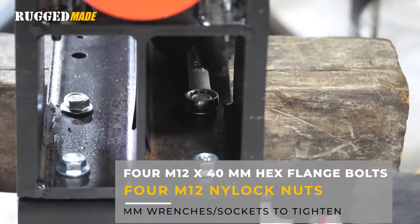Same orientation with the 16 gallon per minute pump — inlet nipple pointing down. The flange here is a little bigger, so there's a little more room to work with, but down at the bottom it can get a little tight. Again, make sure the key doesn't get pushed out of position as we slide it into the jaw coupler. Get all four bolts started before tightening any of them down, particularly the one at the bottom. Now that the pump is mounted and the jaw couplers are in, set the gap between the two jaw coupler halves using cardstock and tighten down the set screws, then put the cover on. These are ready to go onto the splitter.